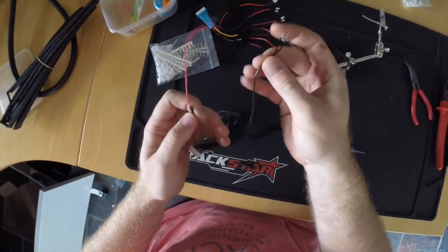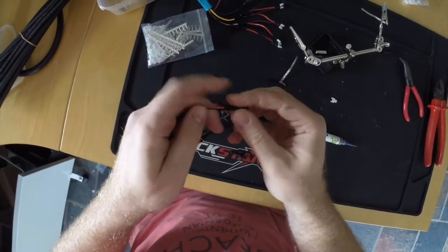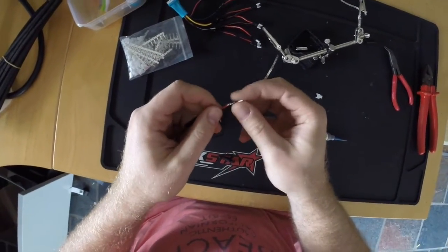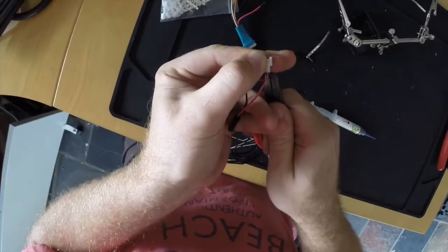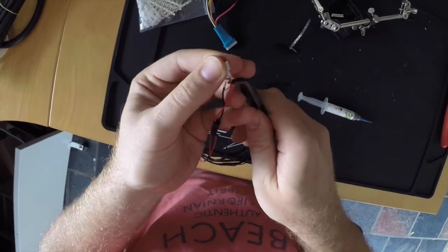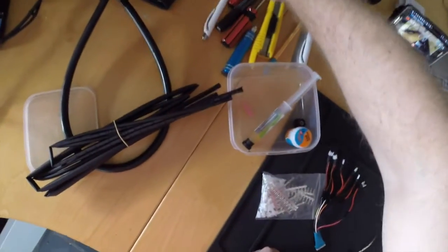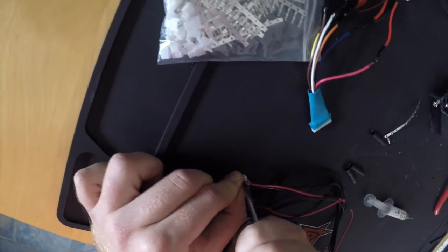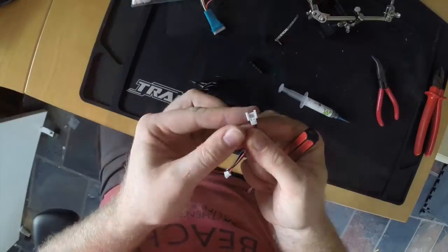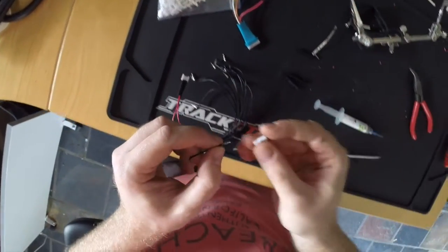Through the glue and the high shrink ratio, it's really grabbing these plugs and gives you a nice handle to plug and unplug them. Each of the pins in the existing connector now has two leads coming out of them. I grab one lead from the very first pin and one from the second — watch that you get the right polarity. Pop them into the first connector. Through soldering these tabs they sometimes get a little bit thicker, so you gotta apply some force to get them into the plug housing. The upside is they don't go anywhere afterwards.